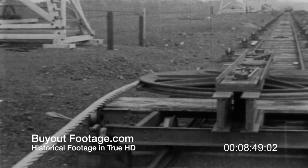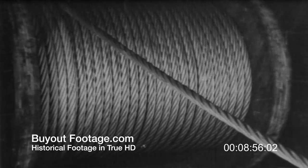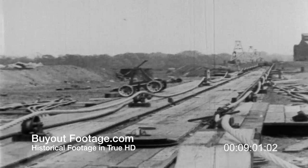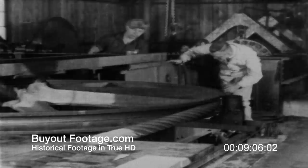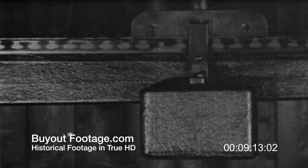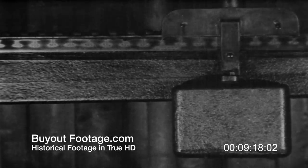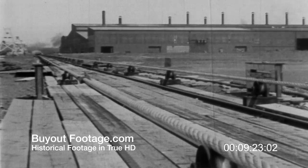But you're not quite there until you've specially prepared each 3,600 foot length. Whatever non-elastic and unpredictable stretch exists in the rope must first be removed by a process known as pre-stressing — another Roebling development for accuracy and safety. The rope is run out as a loop along an 1,800 foot track. By means of a large hydraulic testing machine, the rope is pulled or stressed far above any load it will ever receive in service, and held there long enough to remove all of the unpredictable stretch. Now the stretch can be accurately predicted and the rope will be perfectly elastic.